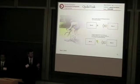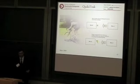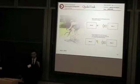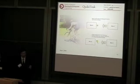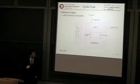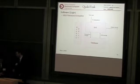The way that we detect the 7-meter length is actually based on a power argument. So when the power reaches a certain threshold, we know that the two, the receiver and emitter, or the drafter and draftee, are less than 7 meters apart. Otherwise, it's greater than 7 meters, and we don't detect drafting. I'll now hand it off to Andy, who will talk about the software.